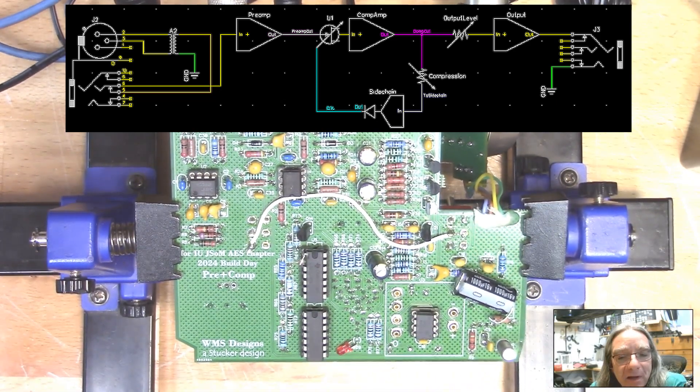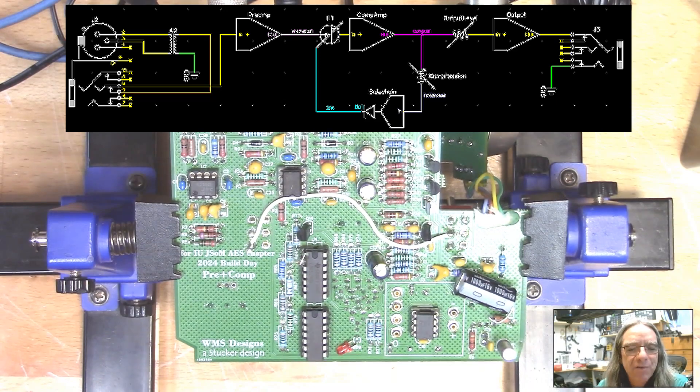Having a block diagram is great, having a schematic is great — without both it's possible to troubleshoot but a lot harder. So I want to cut the circuit in half. We've got signal going in and nothing at the output. To find a middle point: we can think of the circuit as transformer, amplifier, compression amplifier, and output amplifier as four sections. The transformer and preamplifier are the first half, and the compression amplifier and output amplifier are the second half. So we want to test between the output of the preamplifier and the compression amplifier.